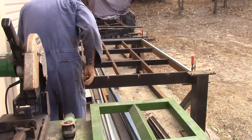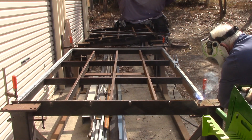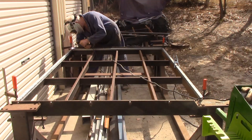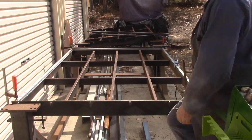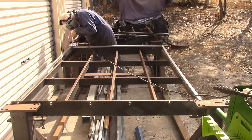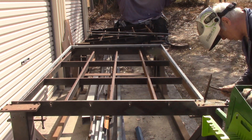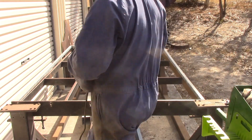Now that's a good fit-up and it's clamped down nice and level, I can just go ahead and weld this. Let's see if we can tack this up — 60 amps on the dial. The key thing here is I want to get the arc started and then go like hell before I burn through the wall. I did a tack and slid down a bit much at the end, started to blow a hole. Once that hole starts to go, she's going to go. I blew a bit of a hole there because of the gap, but I came back the other way and filled it a bit — probably about as good as I'll get it.